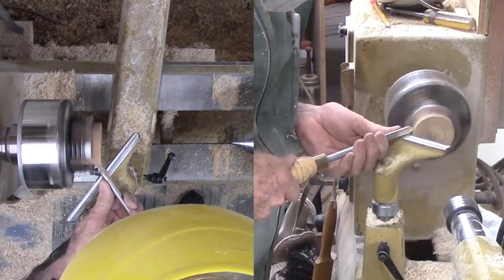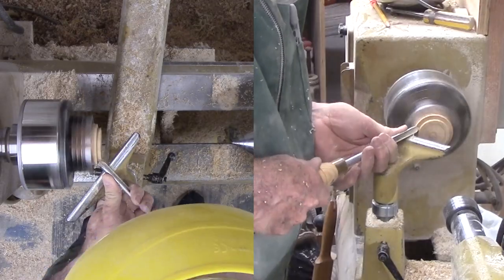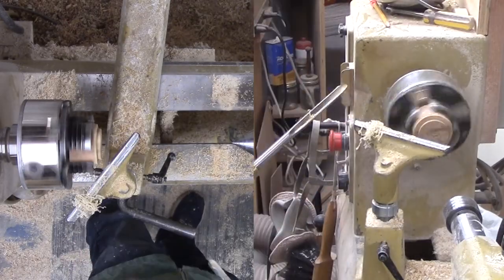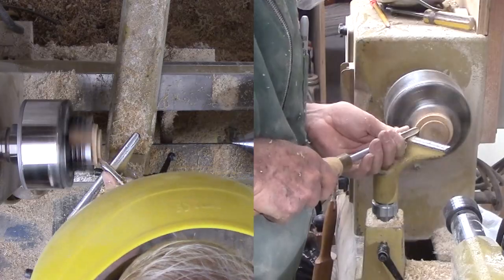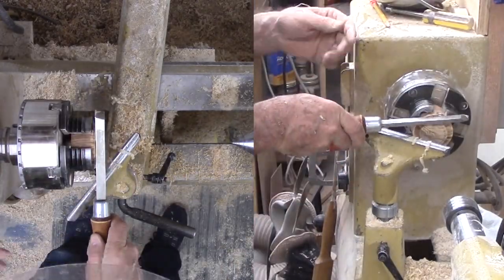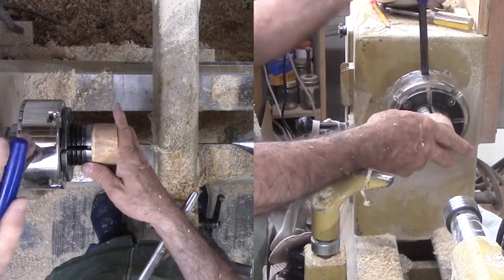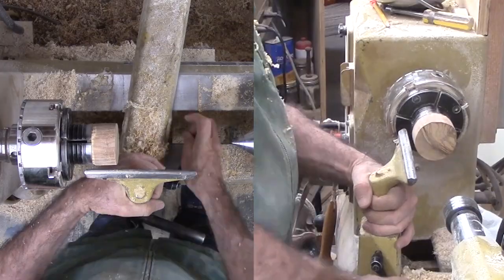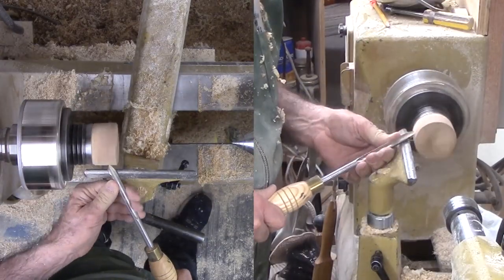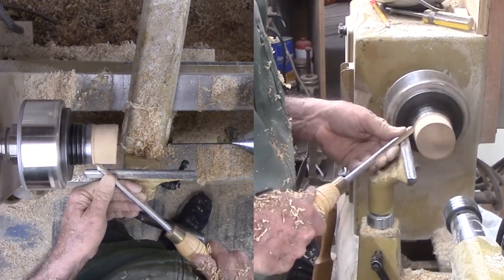About the time I rough-turned this piece, I also turned another piece into a spindle. I sealed it also and let it dry. Now I am cutting a dovetail mount on one end. Next I need to fit that plug to the bottom hole and glue the plug in. After the glue dries, it will serve to mount the wood, replace the pith, and plug the hole.